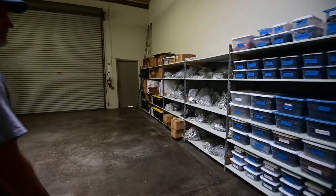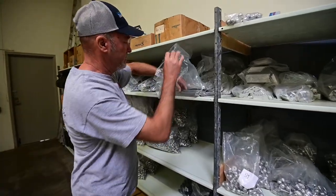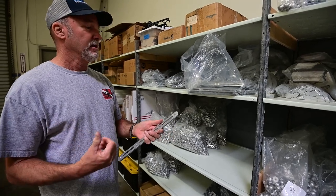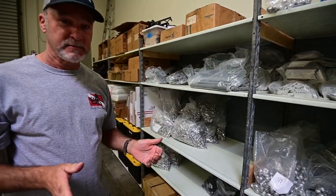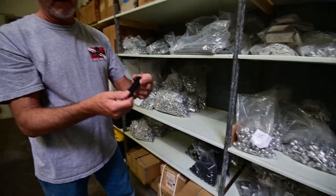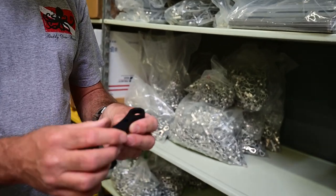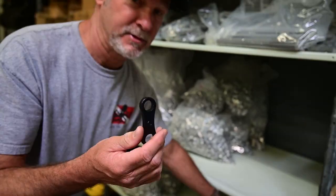We've got a good organization of things. When we get parts, we get them in raw aluminum like this. Sometimes we have to tumble them because the arms have some little sharp edges, so we have a tumbler. Then they sit here until we're ready to anodize. Once the parts are anodized — type three anodizing — that would be this black coating. We do stuff in color too, which is type two anodizing, a little thinner. The black coating is very durable and is probably the best we have.